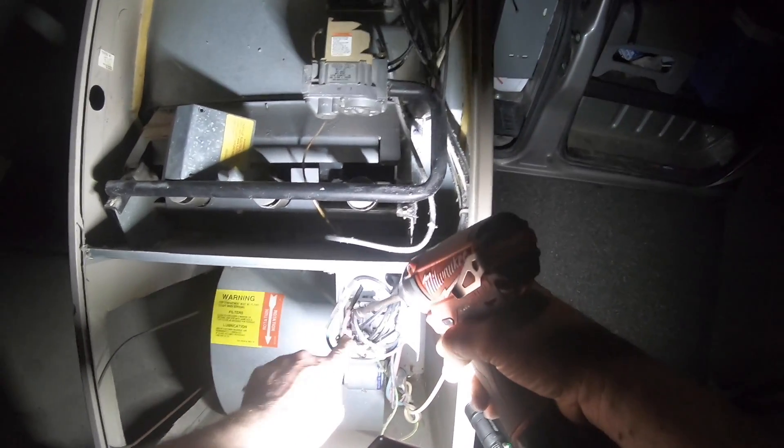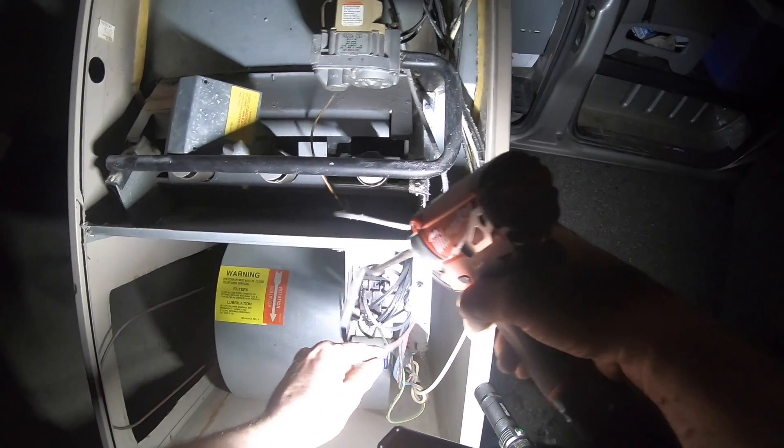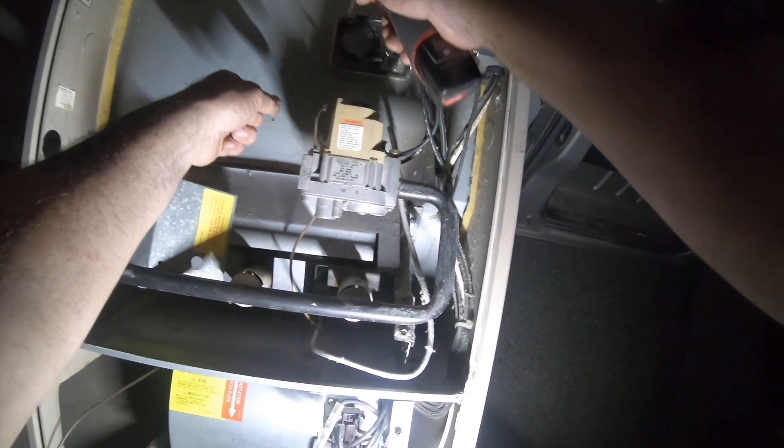Now if you activate G for cooling, you're activating your fan relay down here. If it's a heat call, it's getting activated off your fan relay here.